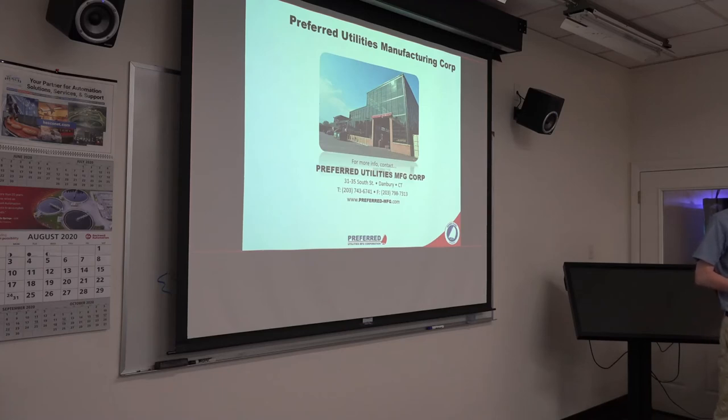Just a comment relative to your 480 volt experience. If you need any more healthy fear, just YouTube arc flash videos. See some interesting stuff there. Where a guy doesn't even make contact, really, just getting close enough. He'll still be standing three feet in front of a panel. Yeah, and in an arc flash incident, you just see this gigantic flash of light, an explosion. And in the video, he's wearing a suit. Right. But even still, it's a very powerful, scary thing.